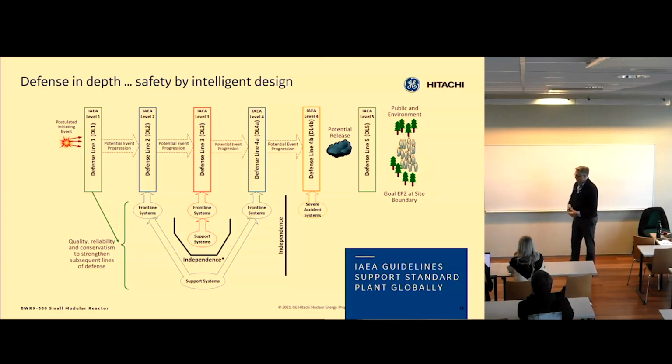But let's say, same scenario, you have 1 pump running, 1 in standby, this trips, and this pump doesn't start because something has gone wrong with it, or it can't see the discharge pressure, or the computer system doesn't work, or something like that. Eventually, the reactor level will hit a low set point, and defense line 3 will shut the reactor down, scram the reactor, and isolate feed water because something is wrong. So the backup to defense line 2 is basically defense line 3 in that case.